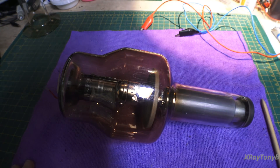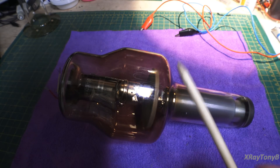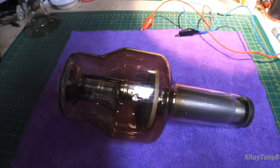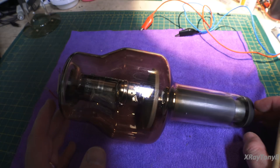Really an x-ray machine's job is to be two power supplies with a timer on them. One power supply drives the filament — low voltage and high current. One power supply drives the high voltage — very high voltage and relatively low current. If you want to call 125,000 volts at one amp low current — because a lot of these will do up to 1000 mA or one amp — that's 125 kilowatts. The bigger tubes are even more powerful. So you're messing with very, very high voltages and radiation that is dangerous.